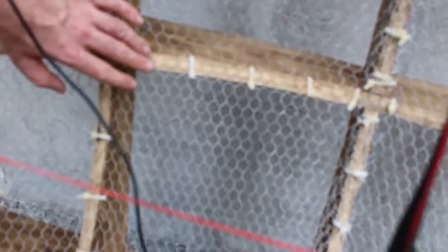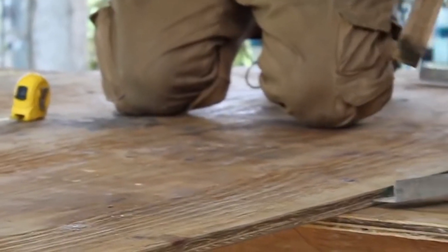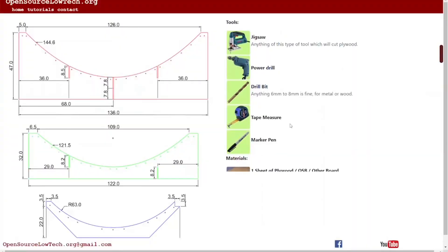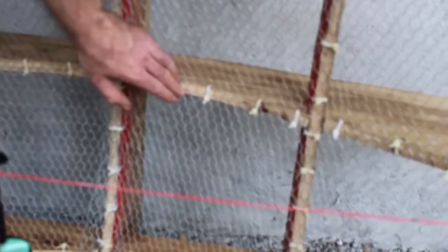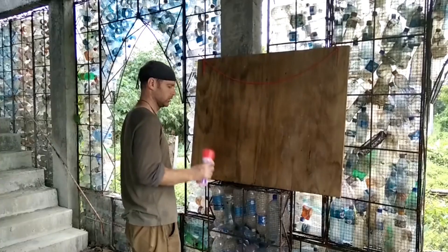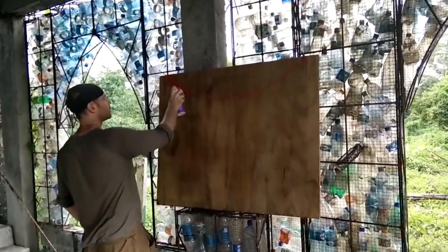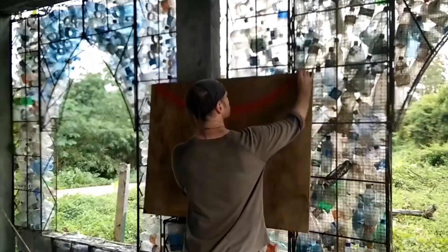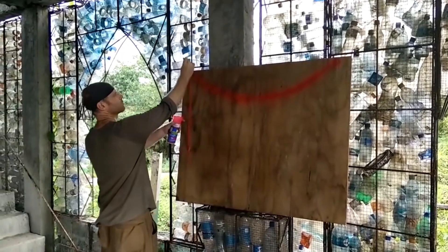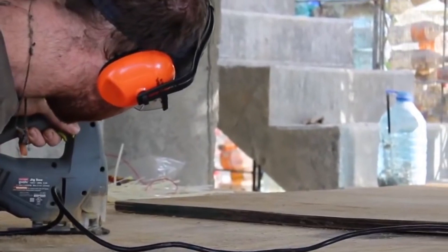Making these slats is super easy — you just mark out the box. There's a full tutorial on the website, linked in the description of the video. To get the parabolic curve, as spelled out in the tutorial, you just hang a light chain of a fixed length between two points, and that'll hang in a catenary curve, which at this kind of focus is very similar to a parabola.